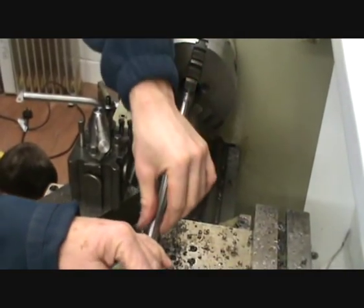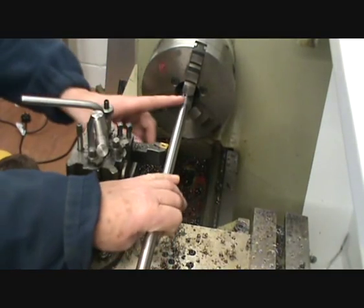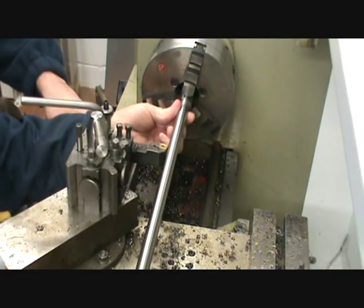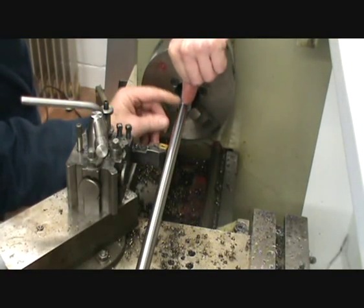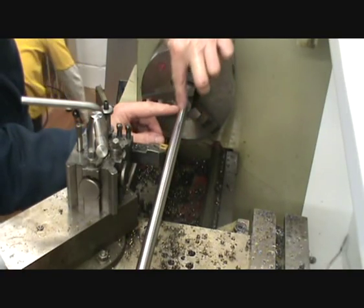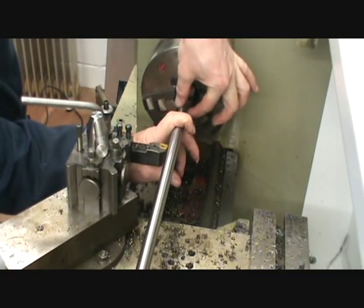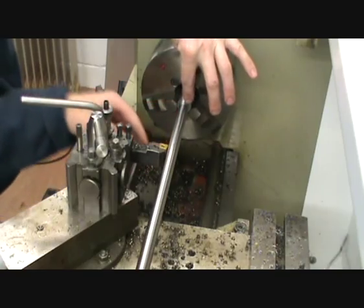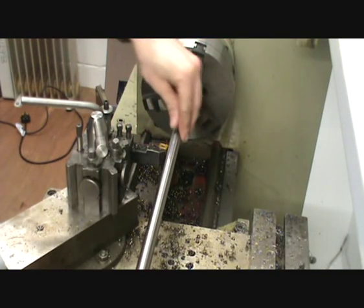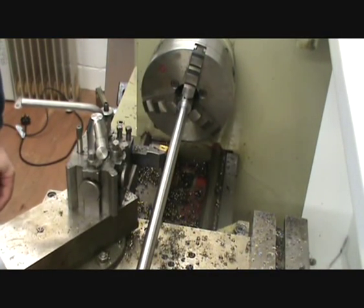Before it was rubbing and really rough to touch. I just need to finish this end up here. I've only machined this section up to there because the travelling steady was going to hit the jaws. So I just need to finish this off now. They'll probably end up being rough again — I'm going to have to use sandpaper. I don't like using sandpaper on things like this; you're not supposed to use gritty stuff because it can get onto the ways.